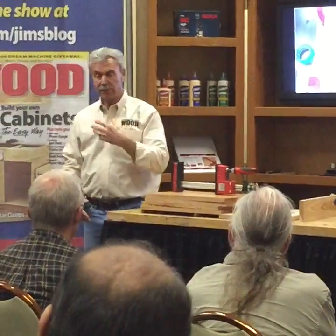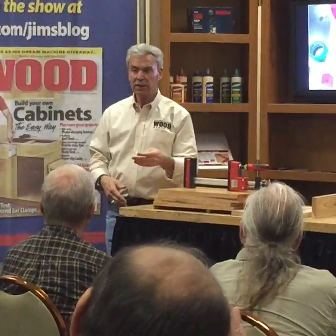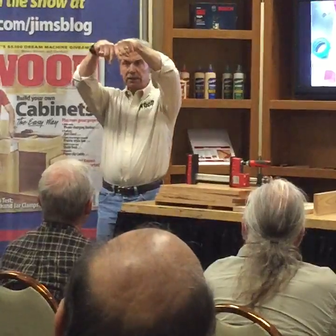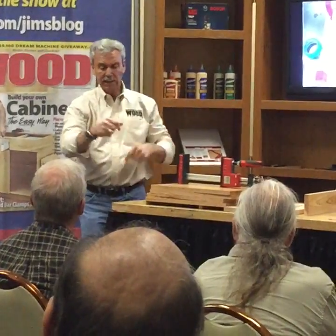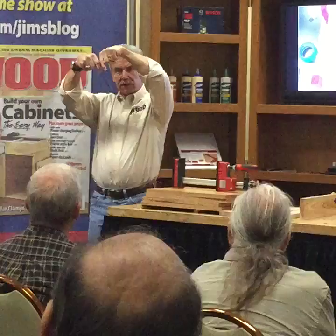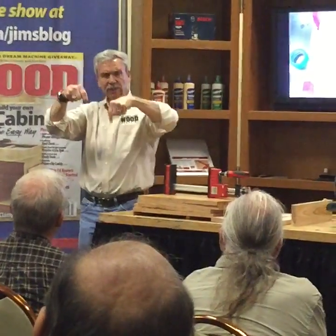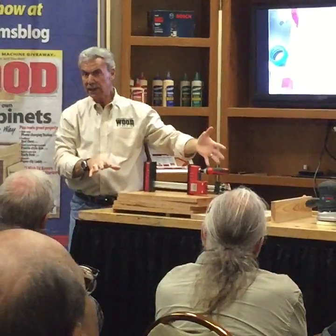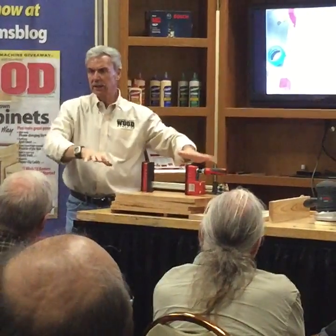A lot of you, and I have tons of them, are using pipe clamps. There's nothing wrong with them. Their ability to clamp something is awesome, but they sit on 2 little feet. And sometimes when you turn the crank on them, it moves that center a little bit, so they don't quite sit flat. So you're not sure anymore whether what you're clamping up is flat, because the clamps are kind of sitting uneven.